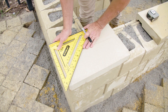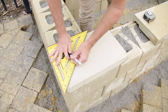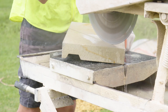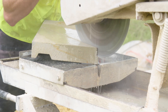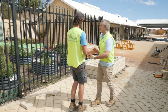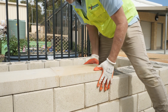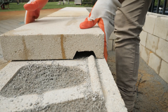To get a nice neat finish you will need to do some measuring and cutting. Run your set square hard up and run it from your outside corner to your inside corner so you get that perfect 45-degree angle. If you don't have access to a brick saw, most machinery hire places will have them available for rent, and if you're not comfortable with cutting, most machinery hire places will be able to do that for you. When installing your capping, make sure that the front edge is flush with the rest of the wall and the locking ridge at the back is lining up as well.